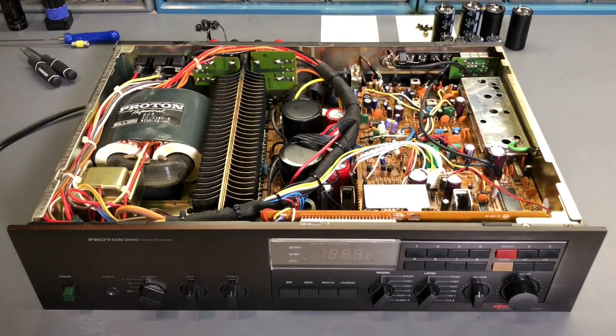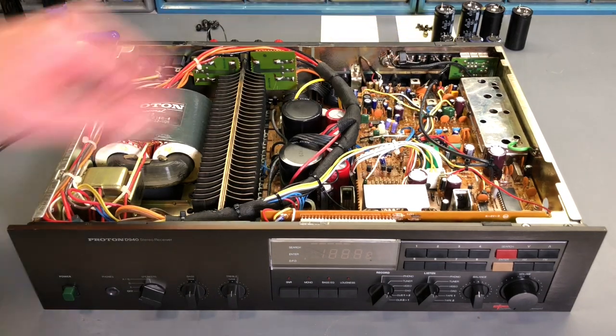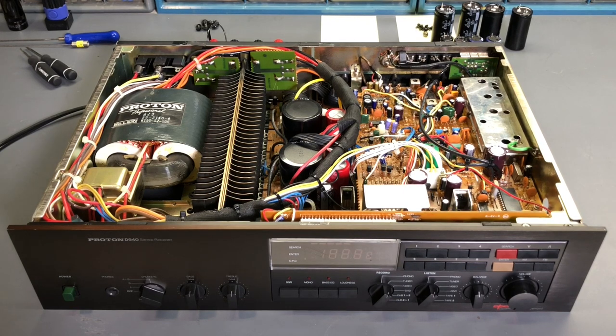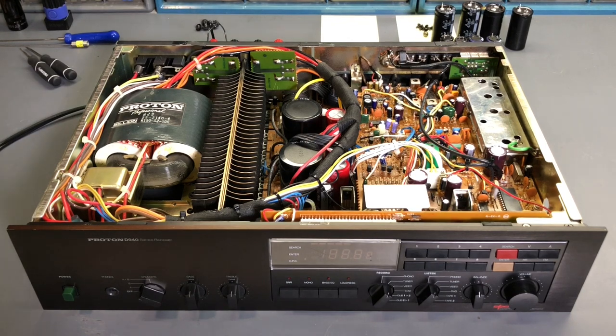The tuner circuit board is now completely installed — the coax cables are connected to the rear panel connectors for AM and FM inputs, all mounting hardware is secure, and the bracket is in place. The tuner is completely finished, but I want to test the AM functionality. I'll use my RF signal generator set to 1 megahertz — 1000 kilohertz — to test the AM receiver. The signal generator is set for 50% modulation with a 1 kilohertz tone. The speaker is now on the left channel, which gives us a chance to check that channel too.